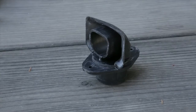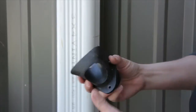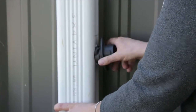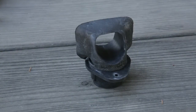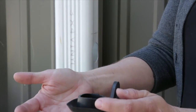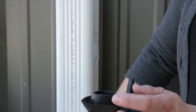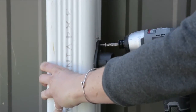This is the connection kit diverter. It's the patented device that Bushman designed for these rain barrels. This is really easy to install. It's a flexible piece of rubber that you just need to fit inside the hole that you've just drilled. But what happens is if your rain barrel fills up, it will stop the water from going into your rain barrel, and instead of that rain overflowing in the cases of other rain barrels where it overflows right there at your foundation, it will seep over and go down your downspout like it would normally. Using the 2 screws that are provided, just secure that.